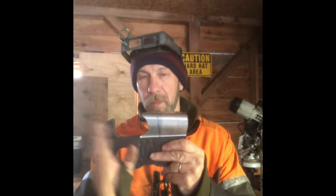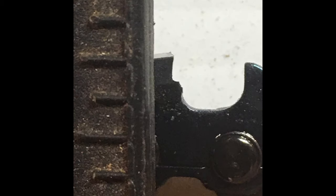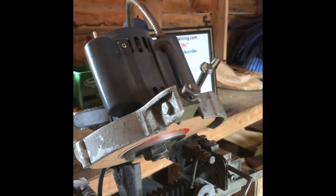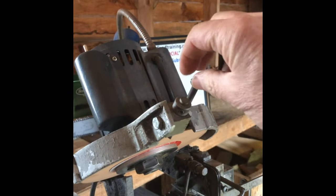I'll post two pictures here. I use a carpenter's square, put it right on your saw bar, and then your eye has something to compare that to. Set that five degrees forward — and again, both your dressers, once you get that where you want it, they're set. All you do is keep your stone clean. I'd like to address in a little more detail this idea of dressing the stone.